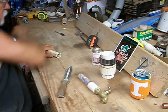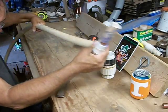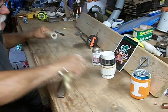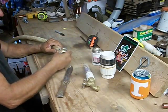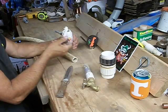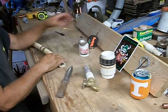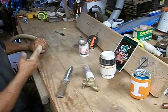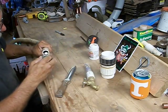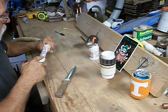If you get past that part that's messed up, it's a pretty good little hose. This three-quarter inch piece of PVC fits in here pretty nicely and it's going to make a pretty good seal. We're going to make that seal better by putting a couple of hose clamps on it so we can tighten it down real good. I'm going to put some of this stuff on it — you'll have to forgive what I called this a second ago. The original anti-leak paste was a product called Rector Seal, and we kind of modified the name a little bit working in the oil fields. I'm going to put a little bit on the inside right there and jab that into place.